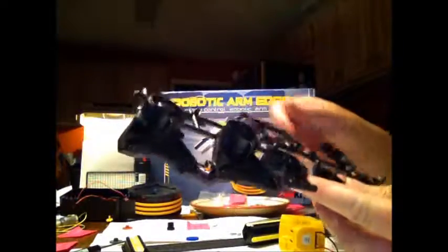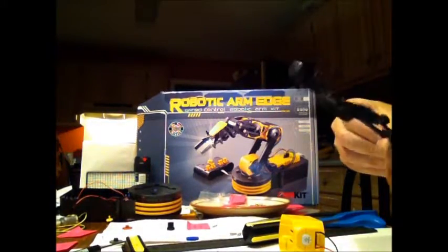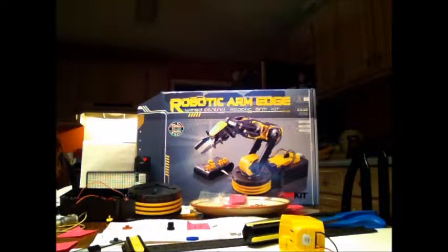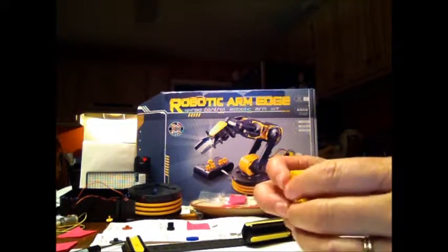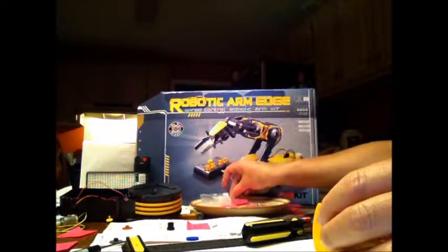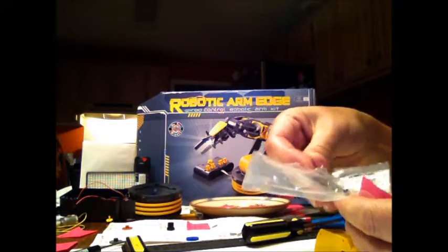The next part of the assembly, you're going to need piece F4, which is this. So you're going to remove that. And you're going to need your M4 motor, which is the second motor with your orange and black wire. You're going to need 2 washers, and 2 P15 screws, and I have mine in a bag because there are 10 of them, and they're so tiny it would have been easy to lose them. So I'm just going to get 2 out.